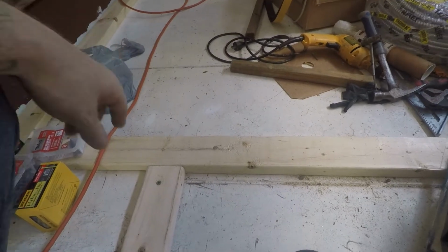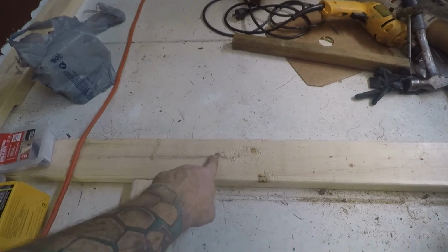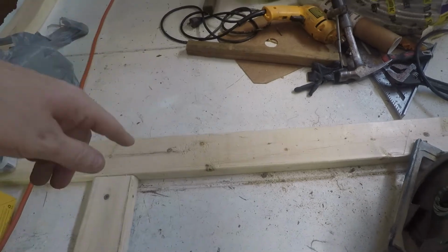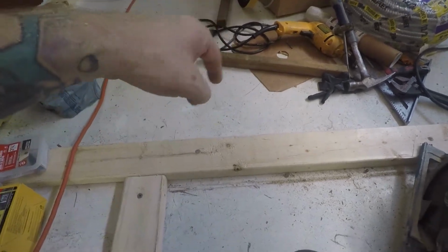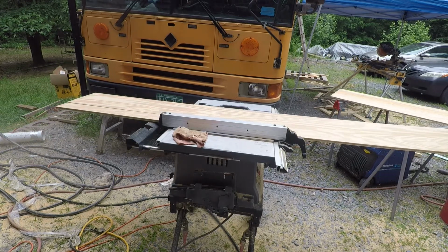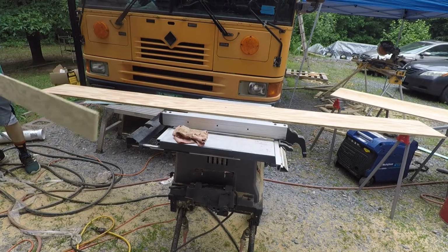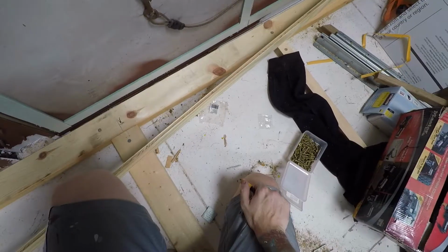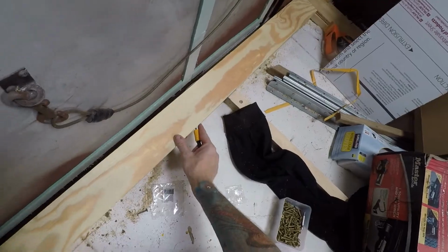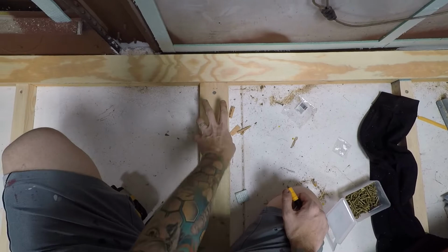The 1/2-inch plywood strips that go on top of here are also going to serve kind of like a thermal break for these screws that are touching the metal, because there are going to be new screws screwing the strips of 1/2-inch plywood into the 2x4. Plywood strips cut out, and I'm gonna do them on the sides first, and then in the middle.